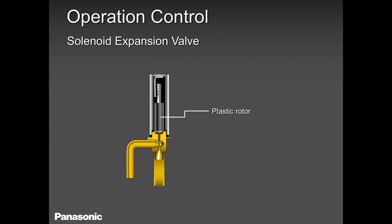When it happens, if I'm the technician, I'm going to say, you told me to change that and I have the same problem again. But you forgot to tell me to put a damp cloth when replacing that electronic expansion valve. So please remember, regardless of electronic expansion valves, coils, whatever, whenever you are brazing a joint, it's always important to have a damp cloth. Always dip it in cold water, squeeze it a little bit, and wrap it around.